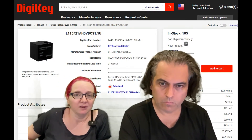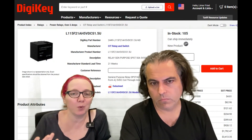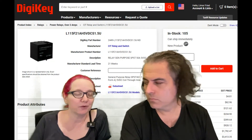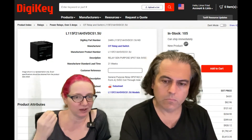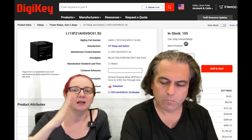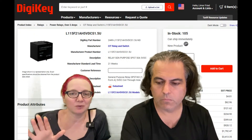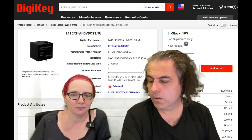It gets lower from there to get a latching relay. If you're doing stuff that's battery powered, or even if you just don't want to waste half a watt whenever you're activating this relay, it'll also last a little bit longer because you're not activating the relay constantly — you only have to turn it on. The plastic latches in place, you let go. It's a little easier: less heat, less wear, less power supply management altogether. Kind of nice. Good pick this week.